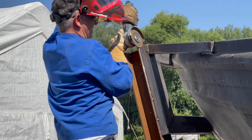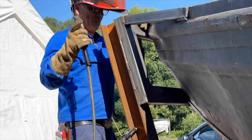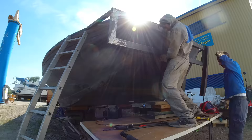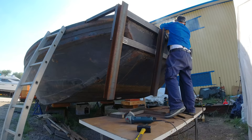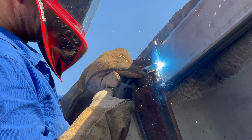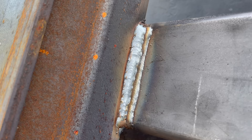After once more preparing the steel for welding, my friend goes ahead and welds the H-beams firmly in place, making sure not to overheat the steel in one area by switching from side to side and making relatively short beads. In the process of attaching these H-beams, we had to make sure that they were not only at the right distance from each other, but also perfectly parallel to each other. When welding the H-beams to the frame, my friend would sometimes place three successive beads on top of each other. This creates one massive weld, which provides greater stability.